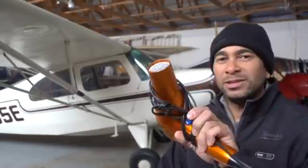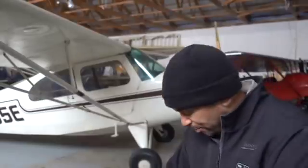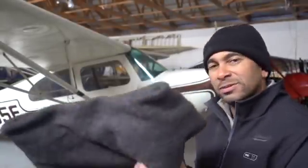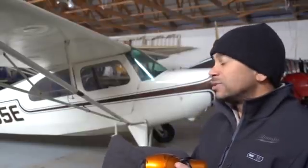We start with a hair dryer. So your everyday house hair dryer. I have a blanket. I got a couple towels. And an extension cord. I'm going to start preheating the airplane. I'm going to go over to my house, eat some breakfast. Come back in about 15 to 20 minutes, and we should be able to start the engine. Right now, we'll have a very difficult time starting without preheat. So let's get to it.